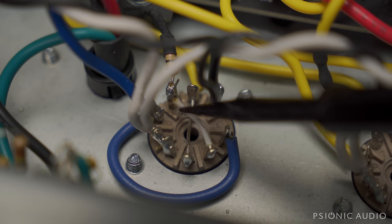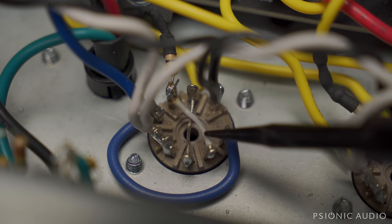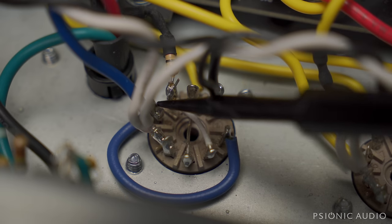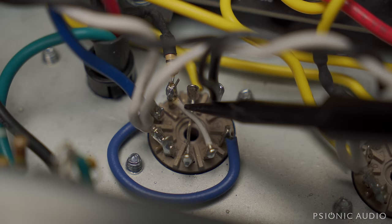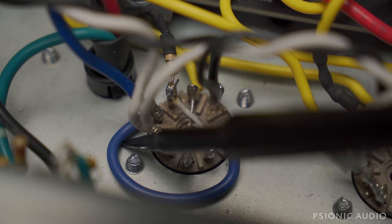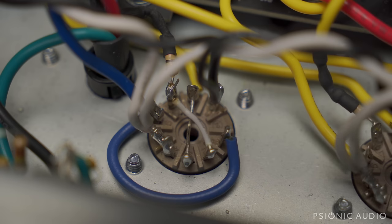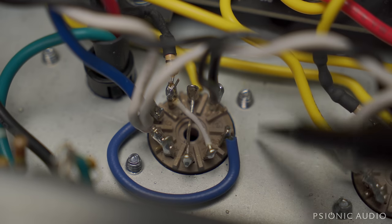The other thing I did, as mentioned in the previous video, was rewire the V3 socket. I kept the cathode crossing across and removed the plate crossing across, which let me keep the grid crossing across without the extra length — because it was looped up and coming close to the heater wires. Now the grid is tucked down against the cathode and the plate loops around, which is how it was done in the 60s amps. This makes a huge difference for the hum and noise floor of the reverb.